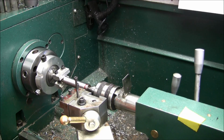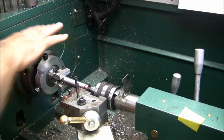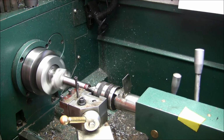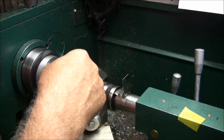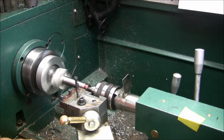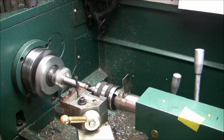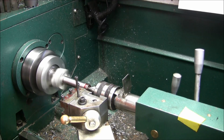In order to do that, I'm going to slow this RPM down. It's a little fast, it's chattering at the bottom of that cut. We are running at 1,000 RPM. I am going to cut it back to 600 RPM. And we're going to have to go 142, not 71. I noticed that by looking at the feet here, they don't look right. They're too big a flat on it. So I have to go 142. So I can go back into the 71. Keep on going.